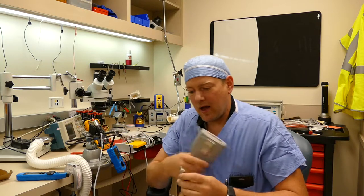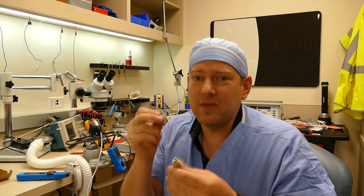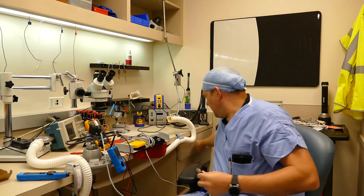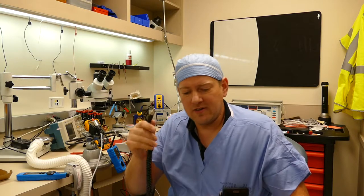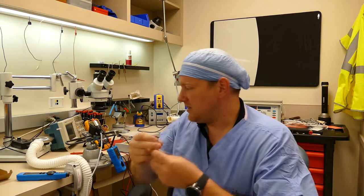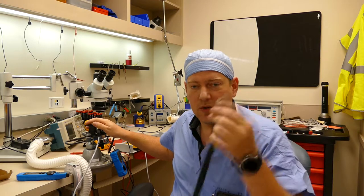Using the same method, I used a small lead that I put on the pin — the lead I used was actually an IV needle. You've got to be careful with needles because obviously you can stab yourself. All my needles are sterile when I receive them, so I open a sterile needle and keep it capped in my drawer with jumpers and stuff for troubleshooting. I have various sizes of needles. Because these pins are kind of small, I shove the needle over one of the pins, clip one of my jumper wires to it, and then use my cable tracer. I found that the break was right here at the connector.